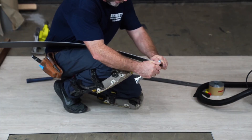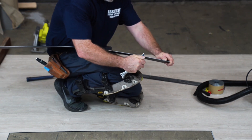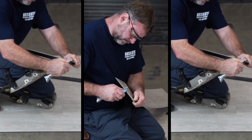With your attention to detail, remove the corners of the existing locking track to make way for the new plank. Carefully remove the factory edges on three sides: the small factory edge on the running joint and both cross joints.